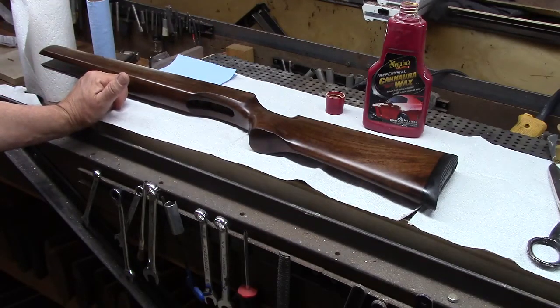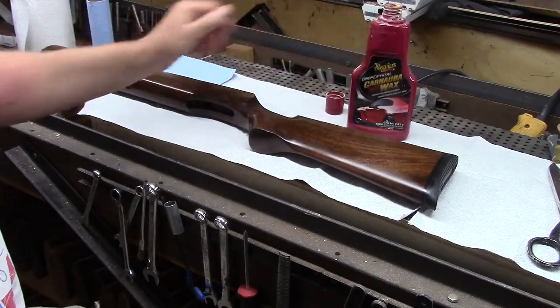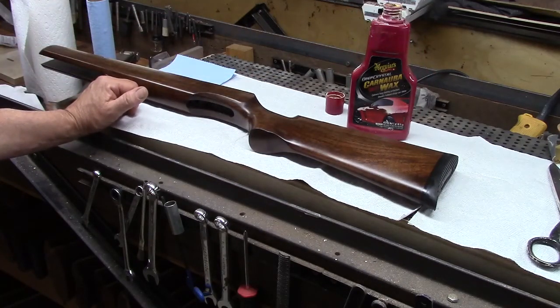And I did a product line that was fiberglass wings and tails that were colored with pigment rather than paint. Those wings, if you took them out in the sun without waxing them one or two times, the finish would turn dark brown. The colors would look horrible, and that was just the end of it. You may as well just paint it at that point. But if I put a couple of coats of Meguiar's carnauba wax on the fiberglass surfaces, the colors would stay pristine for years, decades, a long time.